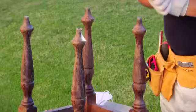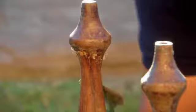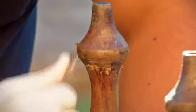While the paint is drying, I'm going to focus on the table bottom. The paint stripper is already dry and I'm going to start scraping off all the old paint and varnish. Remember, use a paint scraper but go lightly — let the paint stripper do the work. A paint scraper works well for removing old varnish from the wood. With most of the varnish removed, move onto fine-grit sandpaper to smooth the wood down to a new, untreated wooden surface.